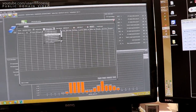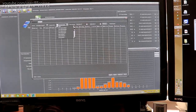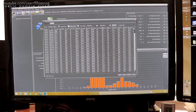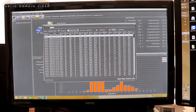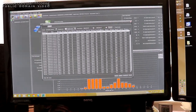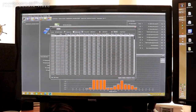If we choose to log with AC8, power, battery voltage and battery current are pre-selected. If we just read that out, you can see we have a huge number of data points. It should right now be logging once every minute to disk on the PC that's sitting down in the basement. So we have battery voltage and battery current - that's all we need in order to use some math magic later on to figure out our battery capacity.